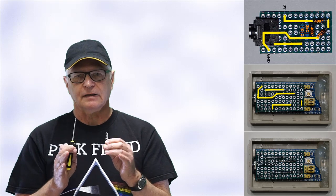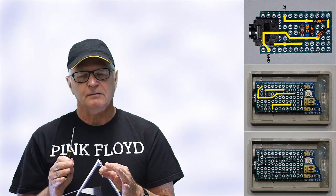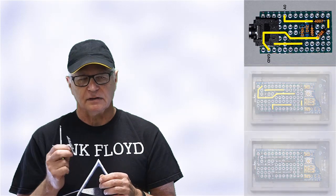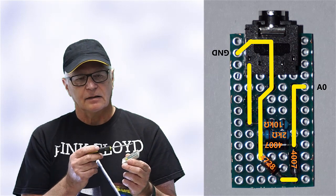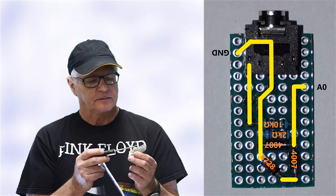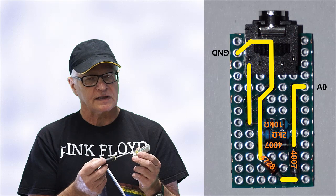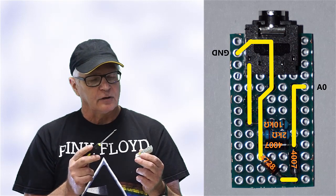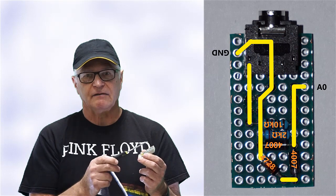Through the information I'll provide in this video, the information in Gadgets number 37, and the three high-res images you can download via the link in the description, you should have all you need to build this. Where this build diverges considerably from others is that the 3.5mm socket sits where the resistors and diodes normally sit. My solution was to move those components further south, toward the center of the board, in a vacant area there. That resulted in using a 7x13 matrix for the PCB board as opposed to the 7x6 matrix.